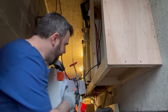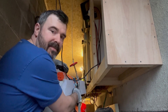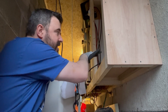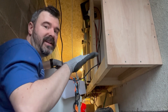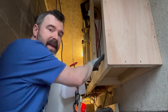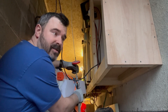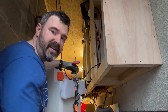I've set my anchor points to the back of the battery. The reason is I want the battery to tilt so the end tilts toward the cabinet - by doing that it'll raise it just a little bit higher, and because it's quite tight here, just high enough that I should be able to swing the bottom into place and then push the battery in. I need to lift it slowly to make sure everything is secure - maybe a couple of centimeters above the ground first - then proceed to lift from there.